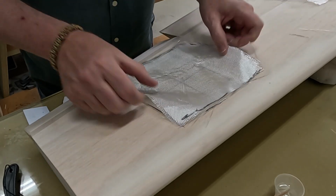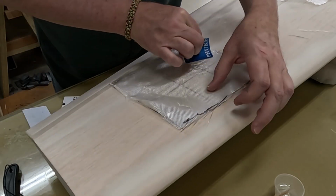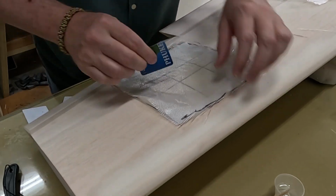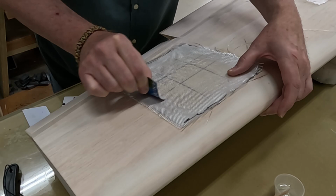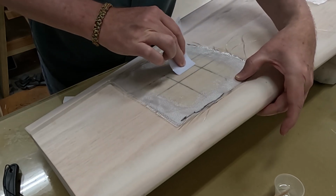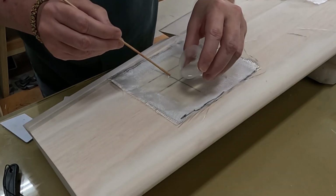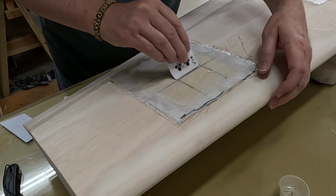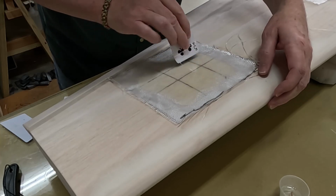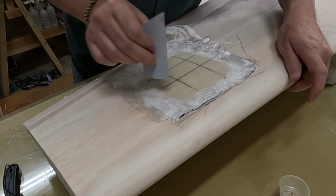After the first piece of fiberglass is down with resin, I lay the second piece of fiberglass on top and use a playing card and a stiffer piece of plastic card to pull any excess resin up through to the second layer before adding any additional resin. This helps to keep the part as light as possible. This way really minimizes the amount of additional resin required to wet out the cloth. The same goes for each additional layer of fiberglass added.